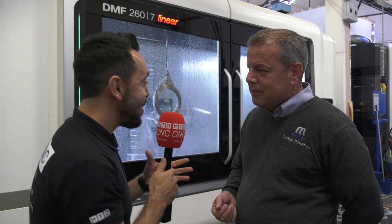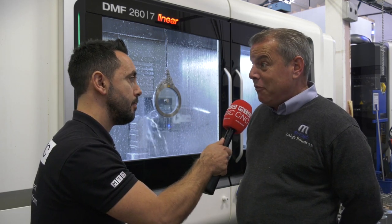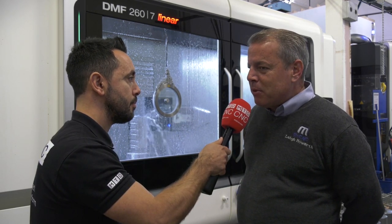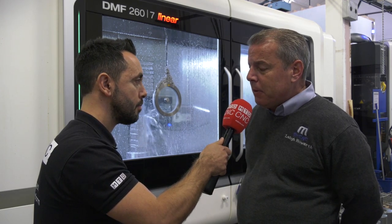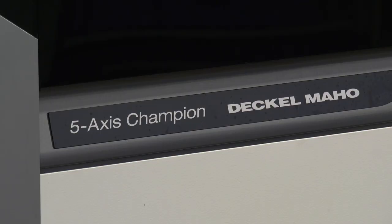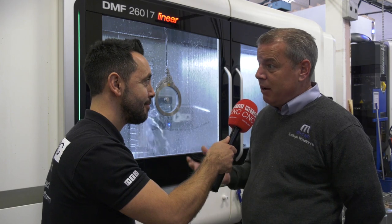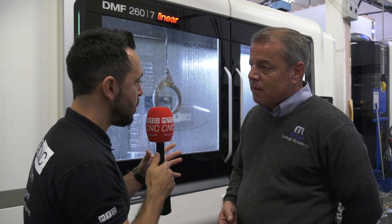Now you've got the wash windows on this, which is something you don't usually see. With the high-pressure coolant, it's nice to be able to see what you're machining, especially with the very complex components there behind you. From an operator's point of view, especially on the first-off when you're proving out a program and bringing in quite an expensive tool - we have some very large drills and twin boring bars - you just want to make sure the axis is going in the direction the operator wants. With the coolant flying around at in excess of 70 bar, the operator can see what he's doing, and that results in fewer collisions.